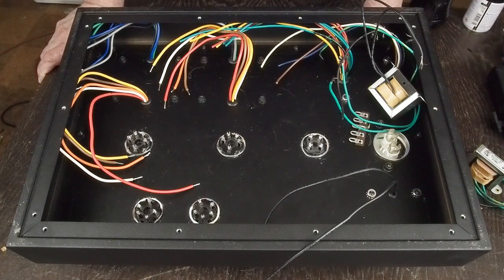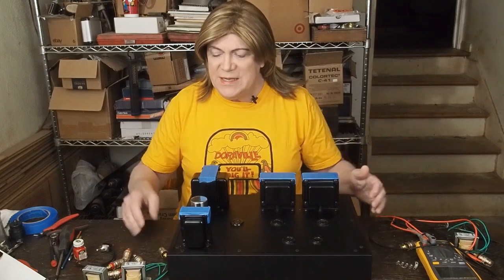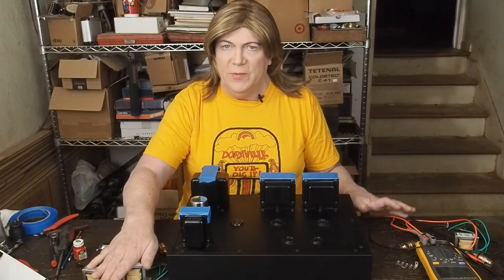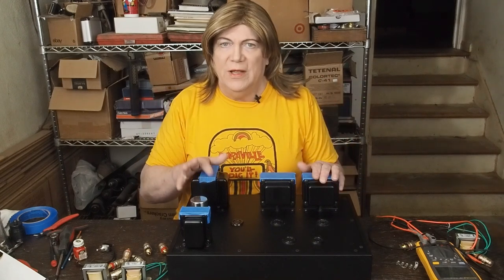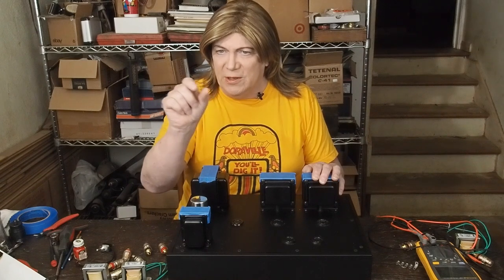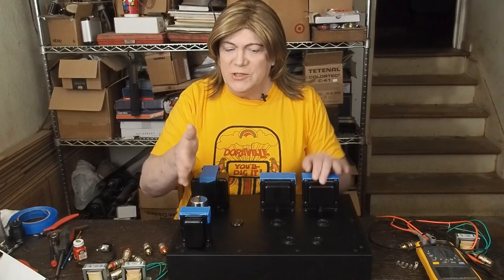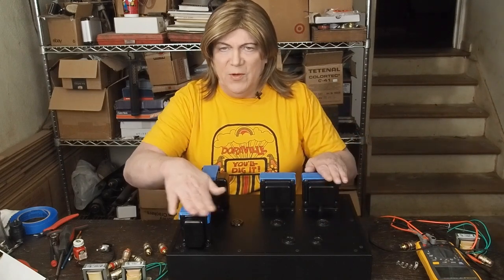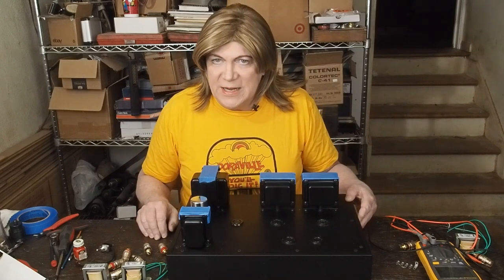I think this is a good place to wrap up this video. I wanted to go through my thought process on the how and why I lay out amplifiers like I do. We're ready now to dive back into fab work on the exterior middle part of the chassis, get our speaker jacks installed, figure out where we're going to put all of our transformers and choke. I did learn tonight about a cool thing — there's a thing called an adjustable power resistor where you can move this center clamp on a power resistor and adjust the ohms it drops across the heaters. I also put some masking tape over these transformers so we don't scratch the paint or the lettering off them. Aesthetics is king on this amp.